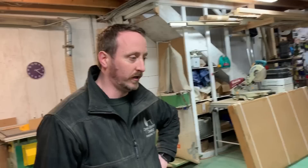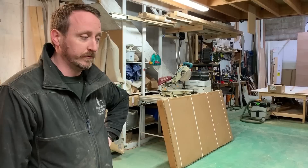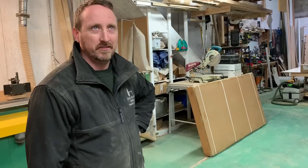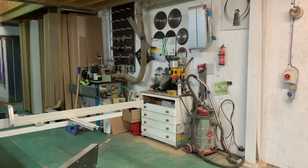What I do is edge band all my MDF, and for shaker doors the way I construct them is I plant my 9mm onto my 12mm — so you always have that inside edge of the shaker style, which is perfect for running through the edge sander. Running through all your 9mm strips pre-sanded before priming — put them through twice. The grit I use is 80 grit — I found it works a lot better. You'll still finish by hand with 240, but buying 180 or 240 for the belt sander was like paper on paper, it wasn't doing anything.